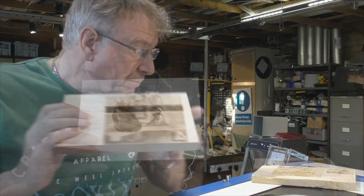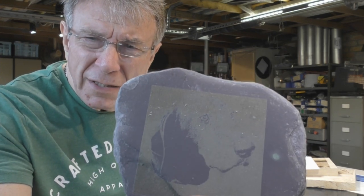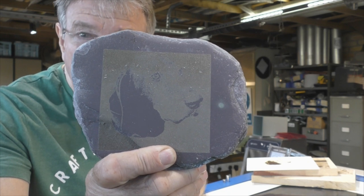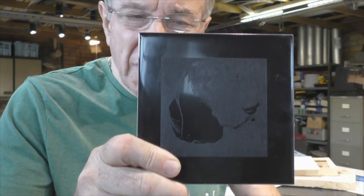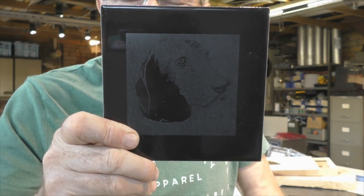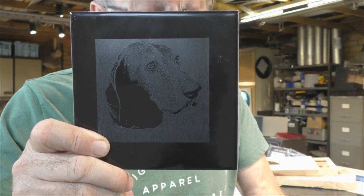There's a whole new set of variables just for working with wood. A similar situation exists for white card, which you can either lightly scorch or take very dark — almost black. Other materials like slate have a very poor color range: there's basically only one color — whatever color the slate turns when you hit it with the laser — so you've only got background color and whatever color the laser produces. That's a very, very narrow dynamic range.